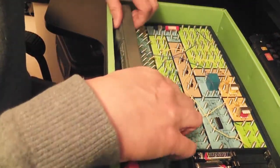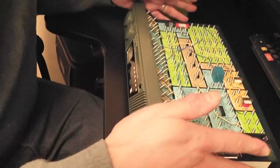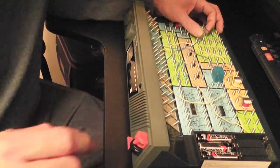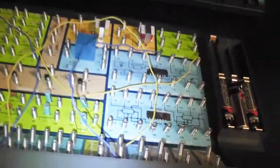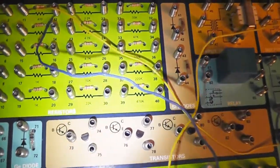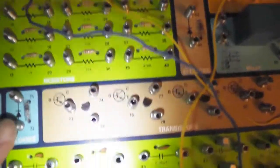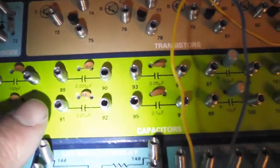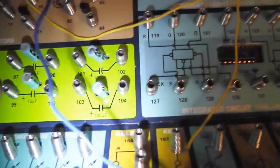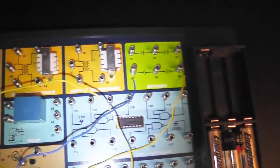Let's actually unbox it because it's better that way. This whole board here basically has a series of springs and electronic components on it. Over here you have resistors of various different values — for example this one here would be a 470 ohm resistor — and you have a diode. The GE diode is a germanium diode. You have a ferrite core, various different capacitors — ceramic disc capacitors, electrolytic capacitors — transistors, a relay, and a pair of input and output transformers.